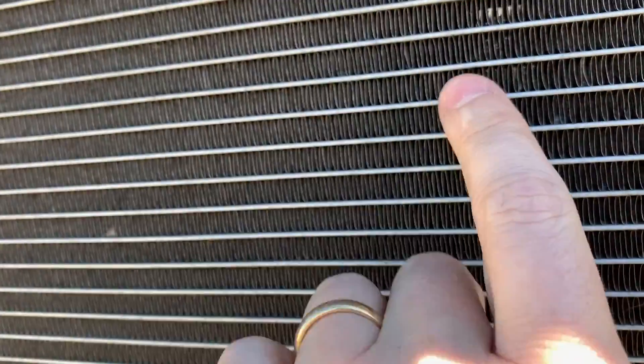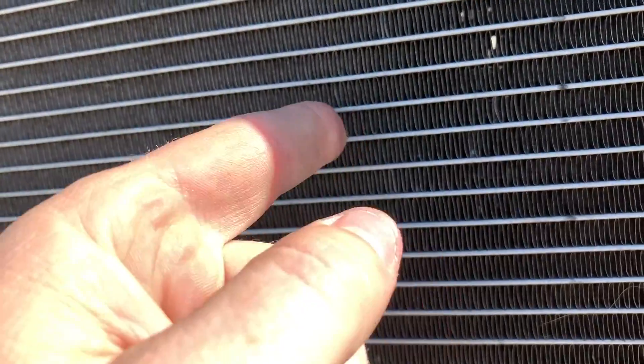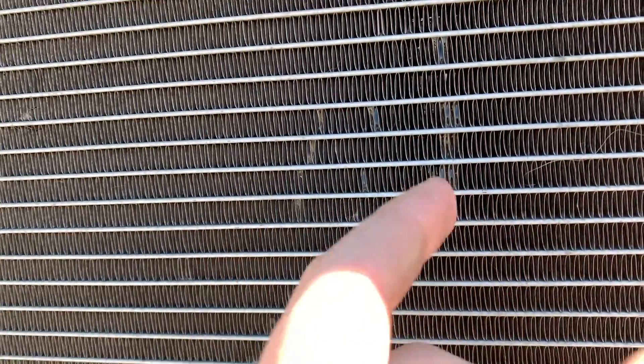The goal of a cleaning like this is to push through the coil and do a really good job of getting the soil out without damaging it. On a microchannel coil, because refrigerant flows right on the edges, that can be a tricky thing to do. You definitely don't want to use a pressure washer. You want something with high flow that gets it clean but isn't going to damage it. In a microchannel coil, refrigerant is flowing right on the edge, right between these flat pieces of coil — there's actually refrigerant in here — and then you have the accordion fins that go in between them.